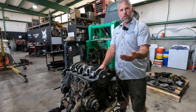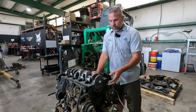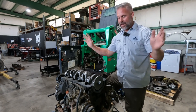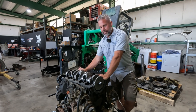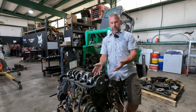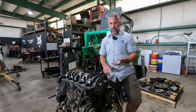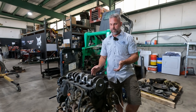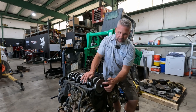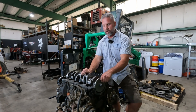Everything looked okay here. I was done — out of ideas. That kept me up all night, and then I thought: what if this tone wheel is not pinned correctly? Because this is a new crankshaft, and you cannot buy this crankshaft from Bobcat right now — they're just not available. So the guy who built the engine ordered this crankshaft from China. What if it's pinned wrong? What are the odds that they drilled the hole in the end of the crankshaft and pinned the tone wheel incorrectly?